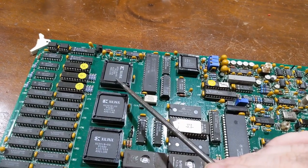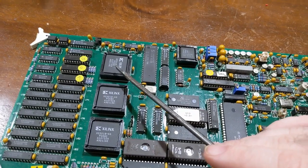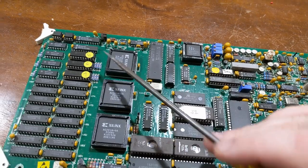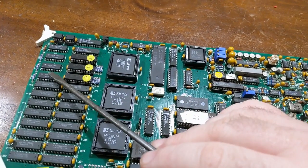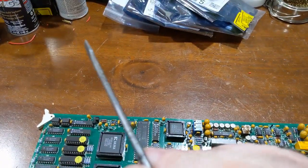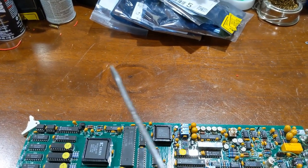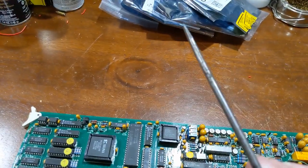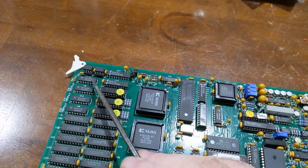This FPGA is the frame buffer control FPGA. This is responsible for switching viewports, doing the crawl roll, all that stuff, through this guy. It controls these encoders. This is a 16-bit counter that counts each pixel that's on the screen. As the lines go across the screen and it returns to the horizontal blanking period, and then scans its way down the screen, every group of 8 pixels is one tick of that timer counter.